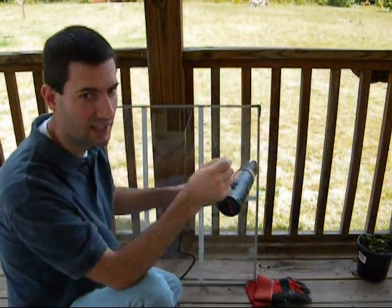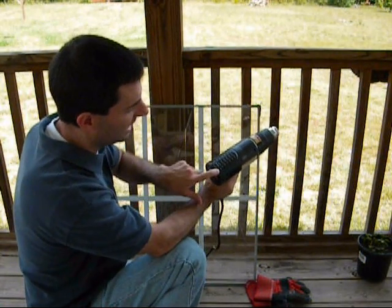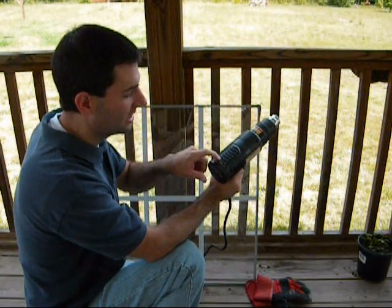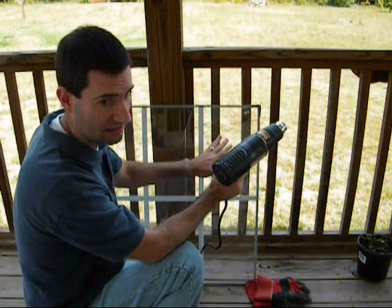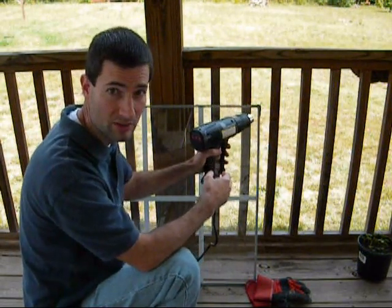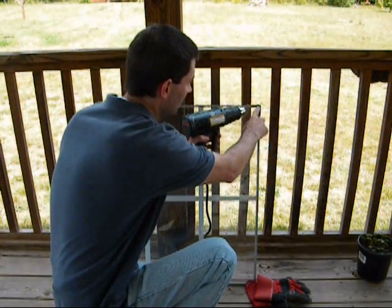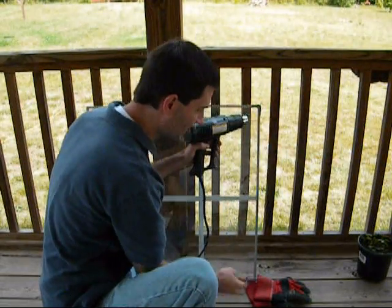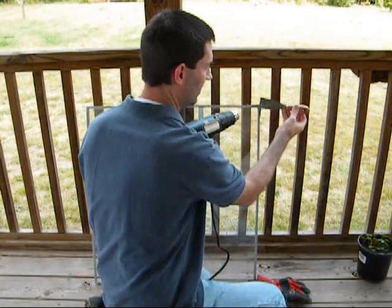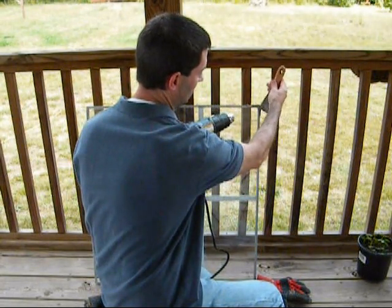And I'll tell you what I'm doing because I'll have to get a close-up. I'm going to use the high-low setting on the heat gun. Anything above that usually it'll crack the glass. I'm going to heat up this gray sealant here, and as I do that, I'm slowly going to take the putty knife and insert it in between the glass and the metal that's in between there.